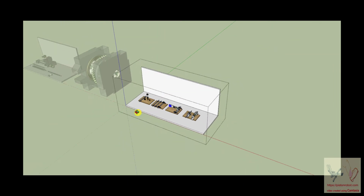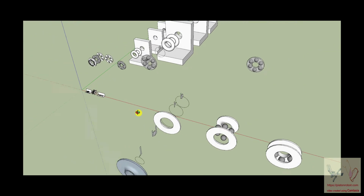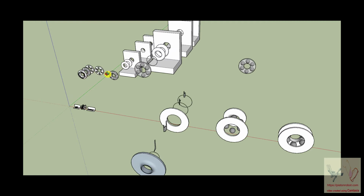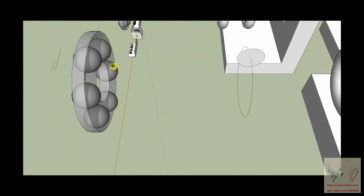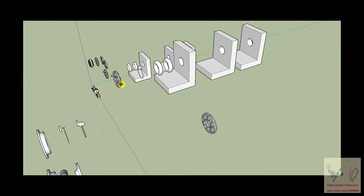One of the things about SketchUp is that it does not like working with these little parts. And so the workshop actually works with big parts. These are times 100. Particularly if you want to add and subtract solids, it's usually unworkable with small ones. Multiply them times 100, multiply them times 1,000, then do your addition and subtraction, and you might be surprised that what used to be impossible is working fine. So that's why they're so big. The whole bounding box problem also goes away with big ones. You just have to remember how much you multiplied by and subtract it back down by that amount.